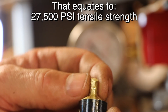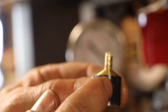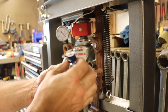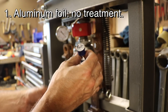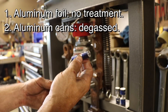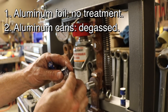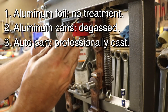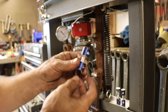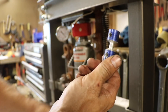I did not treat this metal at all — I didn't degas it, I didn't flux it, I didn't do anything. I just melted it and poured it. I would say this is probably the weakest and most brittle state it can really be in, unless you deliberately work hardened it before you tested it. It held some tensile strength, so that's cool. I've got three aluminum samples here to check. This was aluminum foil — I melted it and poured it, didn't degas, didn't do anything, and it turned out surprisingly tough when I shot it. This is the alloy I used in my AR-15 from aluminum cans — a specific alloy and I did degas this, should be a pretty good casting. This is a turned down piece of an auto part. There are no voids on the professional one, no voids I can see on the can, and I see many voids in this aluminum foil one. I think this foil one is going to break the easiest, so let's do that first.